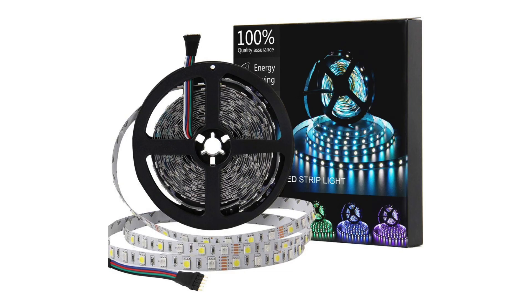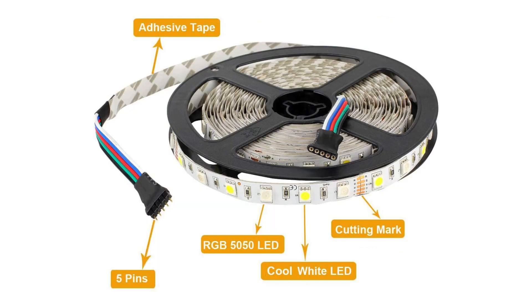Let's start with the LED tape itself. This tape comes rolled up like this, and there's sticky tape on the back that allows you to place it anywhere you want. There are two things you need to know when shopping for LED tape. One is that it comes in different sizes. What we have here in this diffuser bar is 10 millimeter — that's what we use — but there's also 12 millimeter, and that becomes really important when you start buying diffuser bars or connectors. All that stuff has to match.